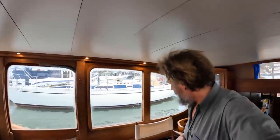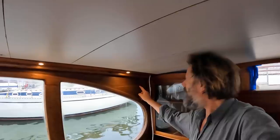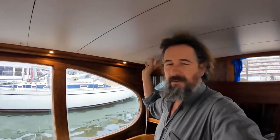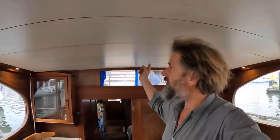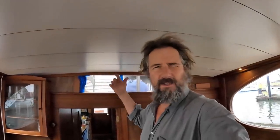Okay, so the problem with that, and why am I getting onto this? Well, it's hidden here by this little stitchwork of Geordie. Let me just move him for a second. That hole right there goes out to where the colored side marker light goes, and it'll be wired up into the overheads here, as well as the lights that go up the mast, which include the anchor light and the forward steaming light, all go up that new temporary mast, but the wiring will be permanent, so I have to make sure I leave enough in it. Now, should we go upstairs?